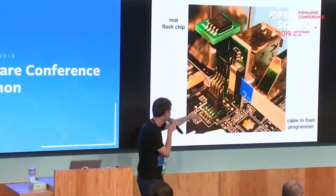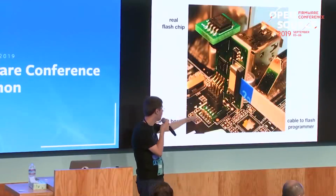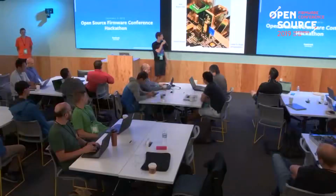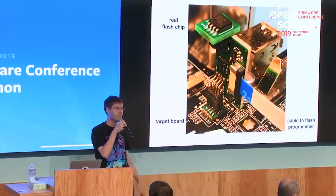Hi, Felix. Just a quick question on the pricing for the BOM. How much would it cost to build yourself? Parts cost. Part costs are, I think, between $10 and $15 for the whole set. But the PCBs, it's not that well visible here. Basically, you need some special process where there's copper at the edges of the board. I have a few samples with me, so you can have a look at it later. That has some initial setup cost, basically once for the whole set of boards. And the board itself is also a four-layer board, so it gets cheap when you order like 100 or 1,000 of it, but just for 10, it's a bit more expensive.